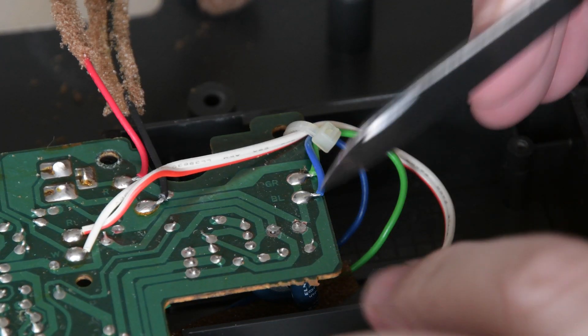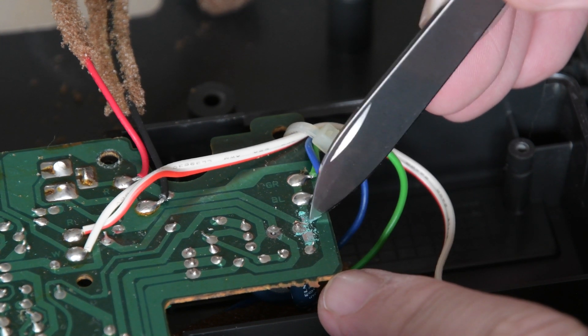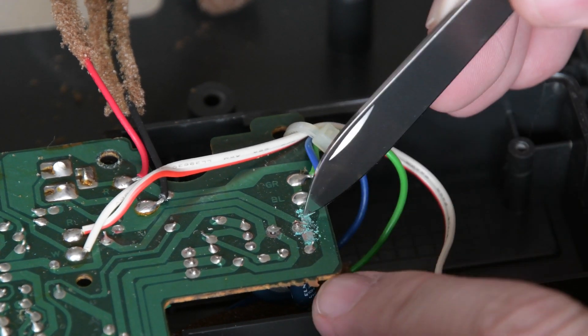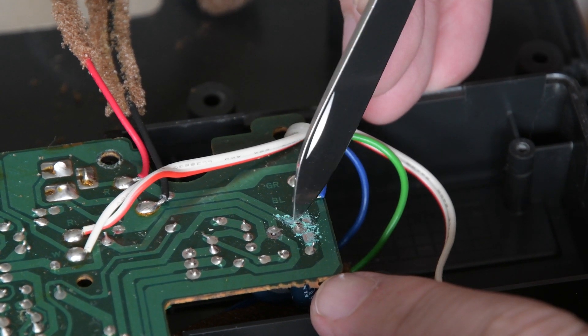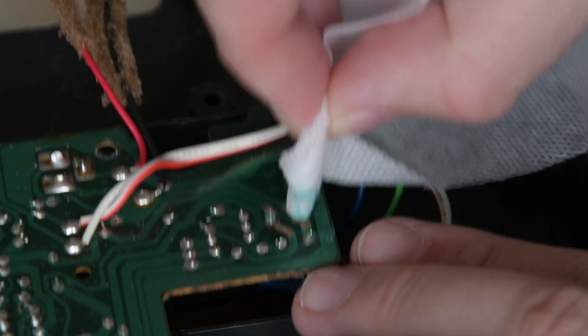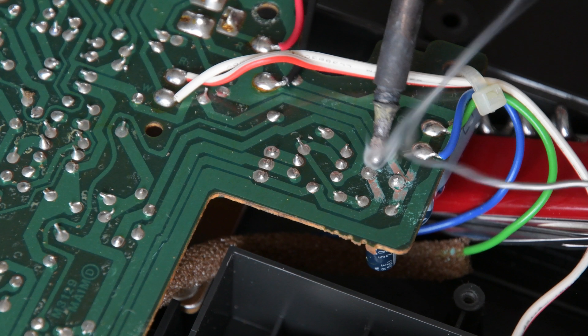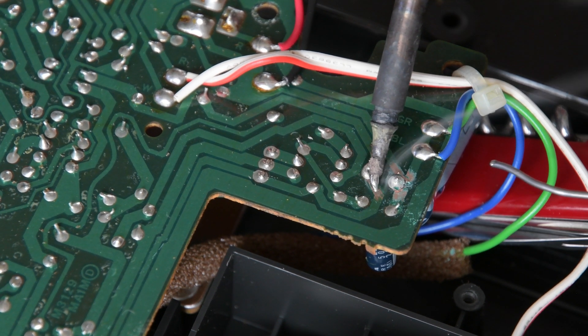To recreate a connection I'm going to take a knife and gently scrape away the PCB paint to reveal the copper track. My plan is to fill the track with solder to bridge across the gap. It might be a little bit bodgy but I think this will allow for a stronger connection for the capacitor to reattach to. It doesn't always stick at first, but the flux makes it a little easier and it does work in the end.